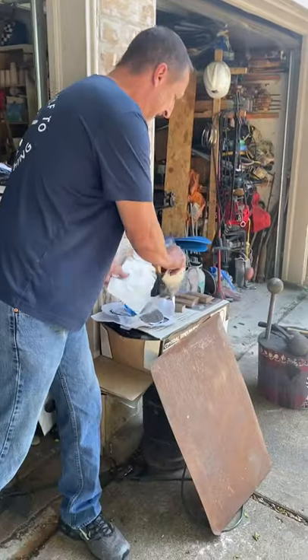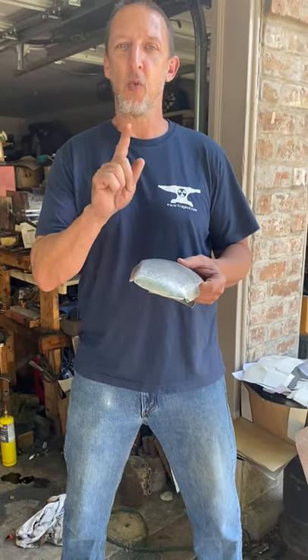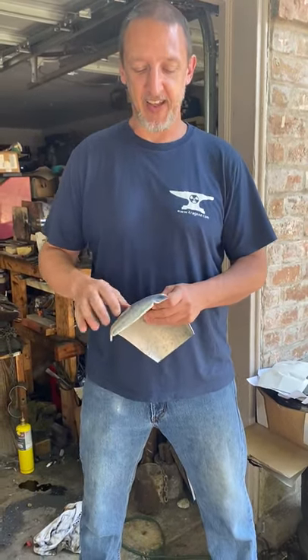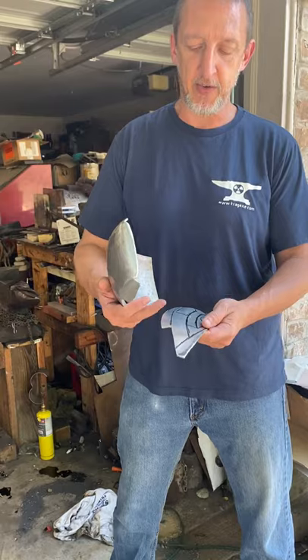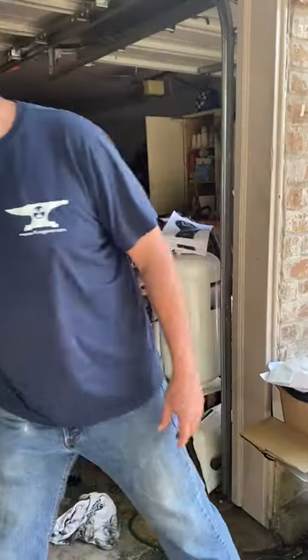I had these great ideas — I was going to do it out of aluminum since it really has the best look and sound. Metal has a neat sound when you walk around in an armor suit, and to kind of match the titanium alloy of the Halo armor I wanted to go with aluminum. But I had some problems using 6061 aircraft aluminum. Once I screwed up the front contours trying to fix it, it quickly became a nightmare — starts cracking on you. It took me about four hours just to get a small amount done, so I'm not doing aluminum anymore for the helmet.